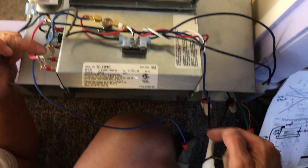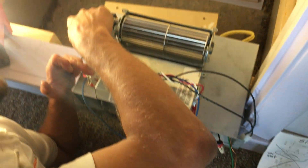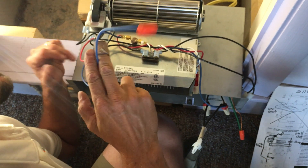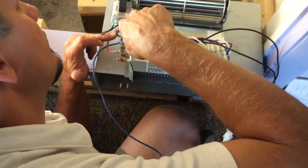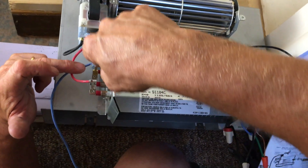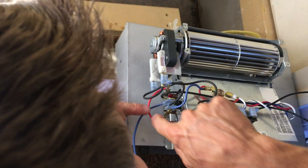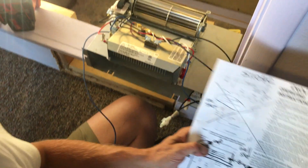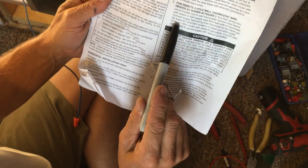Power is going to trace one leg through this thermal fuse to do a check, go through the motor, come through the motor, go through the fan delay, come through the fan delay — and this just caps. Once it goes through the fan delay, it actually comes back here and then goes down, but it does jumper crossed. You don't want to remove that because that means you're going to have a lower wattage — the red jumper right here means lower wattage, and it explains that in the back.